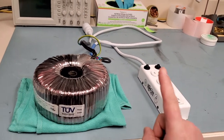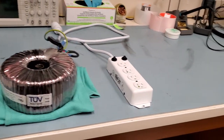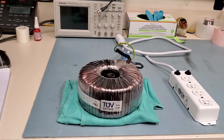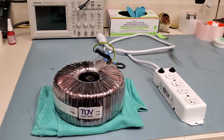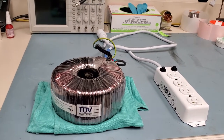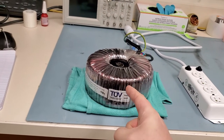The primary reason for one of these transformers is the isolation of mains. Let's say that you're working on a piece of equipment that has physical damage, or maybe even some water damage — some fluid intrusion we don't know about. So when you start opening it up and pulling it apart, you could get shocked. That's the primary reason for using an isolation transformer.